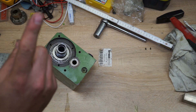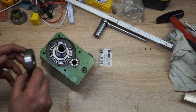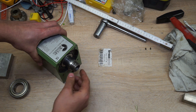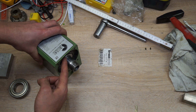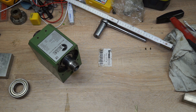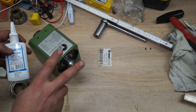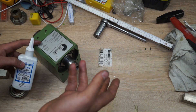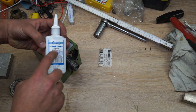Two things I have to do now. First, these bearings are a tiny bit taller than the original bearings, so you can see here that this key is now slightly covered by the bearing — so I'm going to have to cut a tiny bit off the key. And these bearings need to be lubricated. I really should have lubricated this before I put it together, but I got excited and put it together hastily. This is bearing grease.